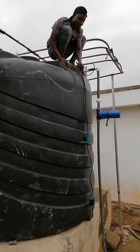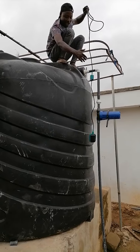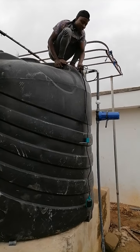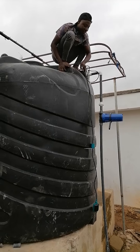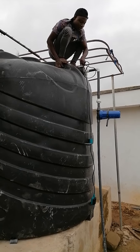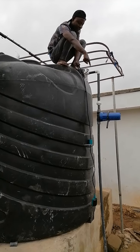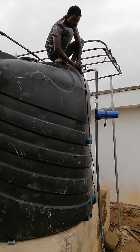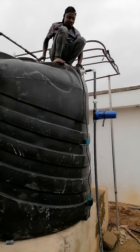So this is how we go about it — you measure to the bottom of the tank, and you make sure the control weight is at the half or the middle of your tank. You can use your eye or any measurement. If you're not used to gauging, you can use a measurement to do that. Get this one at just the middle part of the tank whilst the sensor is at the bottom — that's how it works.